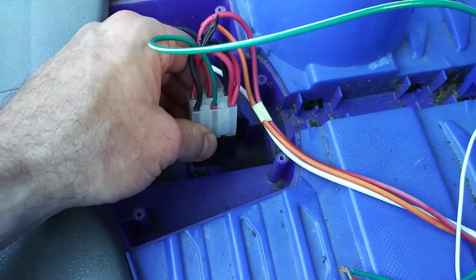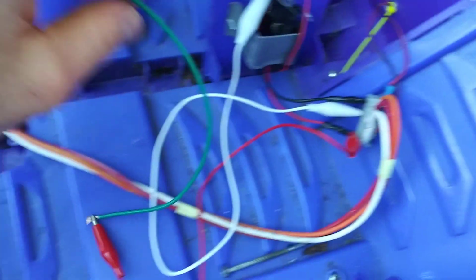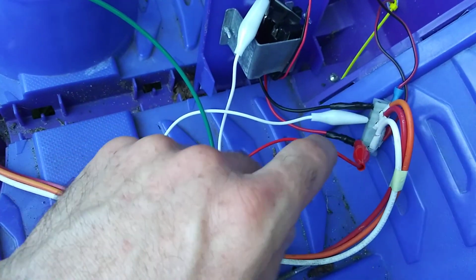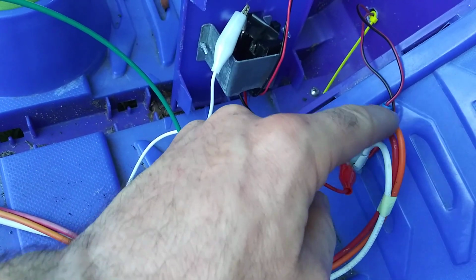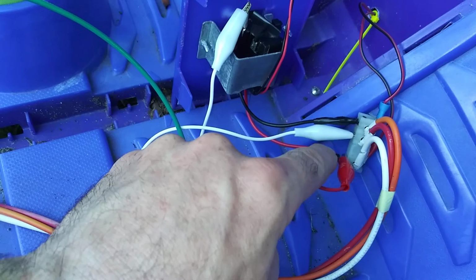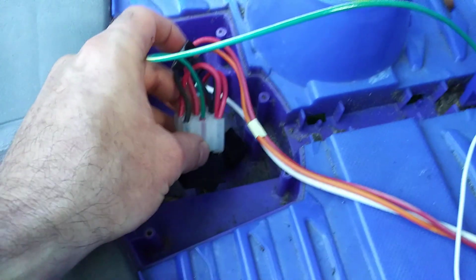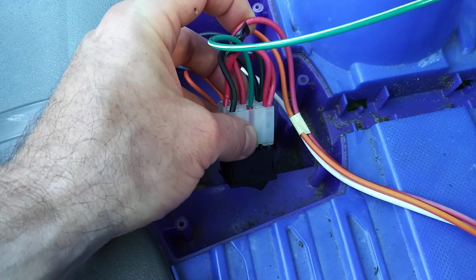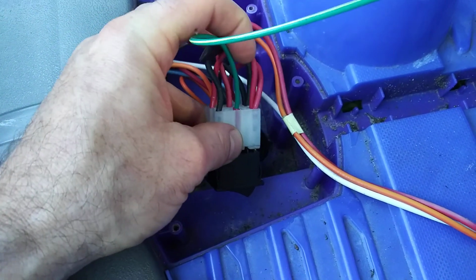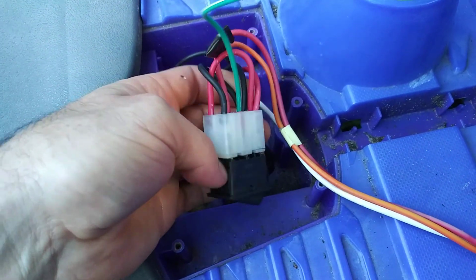Now, here's the one modification. Like I said, this was a wire, which is now connected to here, but that's the mod, right? So originally it was this red wire that came out of here, which would be hot when the switch threw. Red would go down, and now I have it in where the ground was. It used to be where the green wire was.